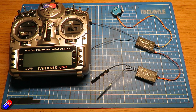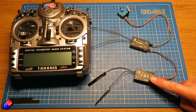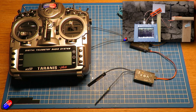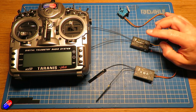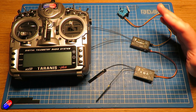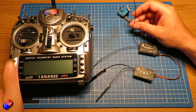Now why would you want to do it? Well it is about redundancy. The idea is that this might be the one that all the servos are plugged into and then you might have a separate auxiliary receiver somewhere else in the model. The issue with really expensive models is do you want to rely on just one single receiver to do everything? And if those models have lots of metal or carbon fiber in them, it can be tricky to make sure the antennas between the radio and the receiver have a nice clear view all the time.